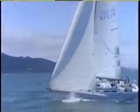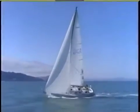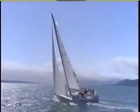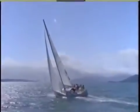Aerodynamic theory predicted that in heavy wind, a long luff and short overlap headsail, like this 105% blade, would be a winner. Our practical experience confirms this. The blade barely overlaps the mast, and it's only a foot or two short of the masthead. The short overlap keeps the slot open, even with inboard leads. This means the main traveler can be eased off in the gusts without excessively backwinding the main.